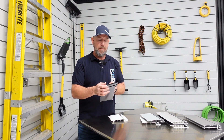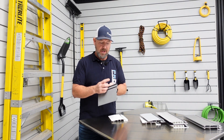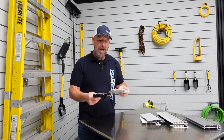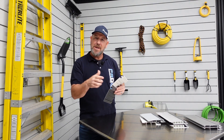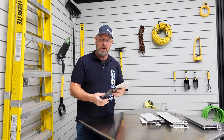What's key to this panel is that we put our screw cavity hidden above our hook cavity. What that means is two things. Number one, we're putting a screw right where you're going to put the hook, so it adds strength. Number two, we're able to hide that screw to give us a really clean finish, but also allow us — sometimes maybe we thought the stud was there, you miss it, you put another screw in. Well, you don't see the hole from the previous one. It doesn't change the integrity of the product.